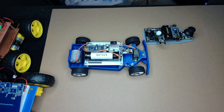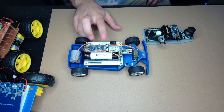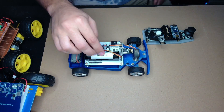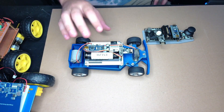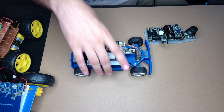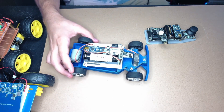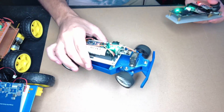In and of itself, it has some problems. For one, it's a dual H-bridge driver with two sockets to hook up motors, so you can do two motors for other projects with the same board. However, it really can't power the car — it's just not powerful enough. The battery can do enough current, but the 5-volt boost just really can't handle it. And on top of that, if there's too much noise in the system, the Arduino just crashes. This works in its current state, but if I wanted to make it a teachable project, it only has this one use — it's not really a developer board. You can't do anything other than the one project I designed it for, which is not my intention.